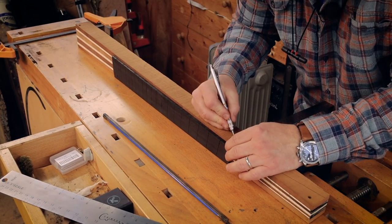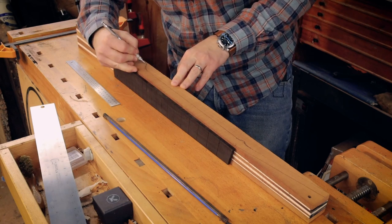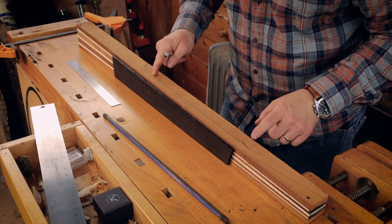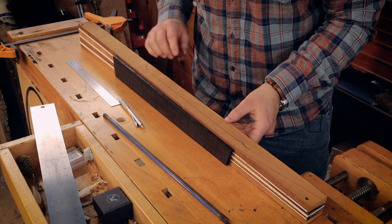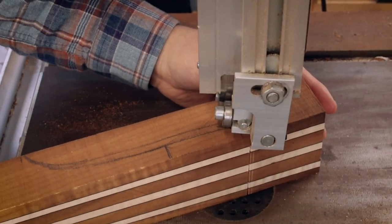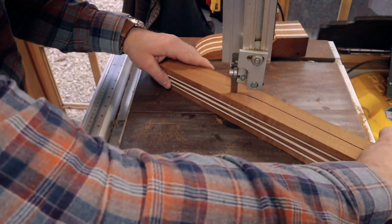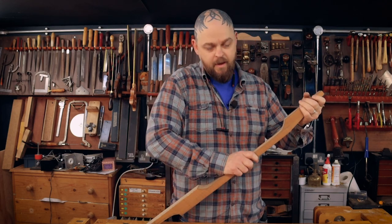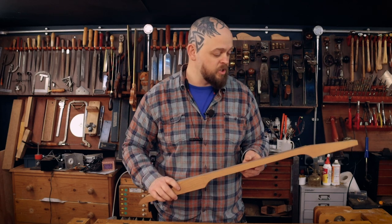I'm going to make this much bigger than it needs to be - just there. This will be dealt with later. Now I can remove all of that material up to here. I'm just going to chop this section out here to see if there's any movement up or down, and I'm going to sort out the headstock break angle while I'm there. The neck feels solid as all hell, so I am not worried. I will not need carbon fiber stiffening rods. We're pretty much good to go.